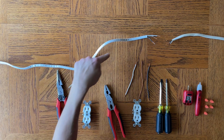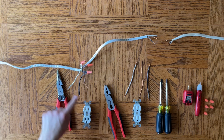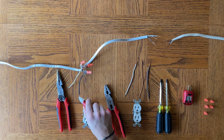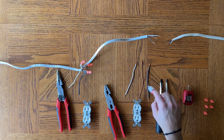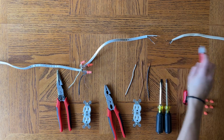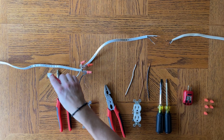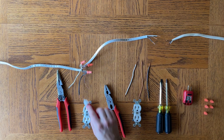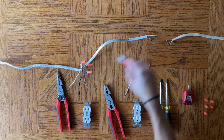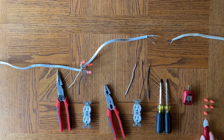At this point, if you turned your power on, it would be coming down and powering these — so this one would be live. If you took your tick tracer, this would illuminate, but these would not because nothing is connected to those outlets yet. So right now you've just connected your power to this line, so this would now be hot. The power would continually be flowing here, and if this outlet failed, you're still going to have power continuing down the line. You're pigtailing off — the power source is continuing down — so essentially you have two currents running parallel to each other.